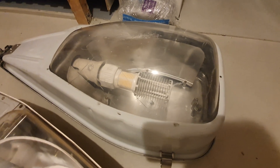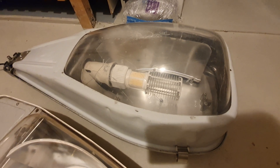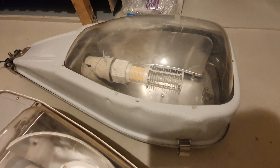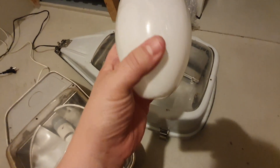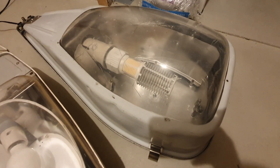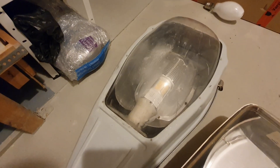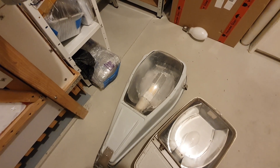We have fitted the first bulb. This is a 250 watt high pressure sodium fixture and this is only a 150 watt replacement — I don't have a 150 watt HPS light at hand. Also, this fixture is meant for globe-shaped bulbs and the correct bulb for it is a 250 watt globe-shaped HPS bulb, whereas this LED is a tubular replacement. So it's not entirely optimal, but the instructions don't say it must match the exact lamp type. I've tried this before and it didn't burn up, so let's start it.